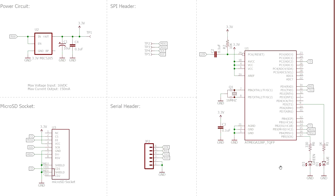Here is the schematic of the Open Log device - there's really not very much on it. The main thing is the ATmega 328P microcontroller, programmed to take a string of RS232 data in and write it to an SD card. To help it do that we've got a 16 MHz crystal, a decoupling capacitor, and a couple of LEDs which flash when the device is receiving data, though their exact functionality isn't very well described.